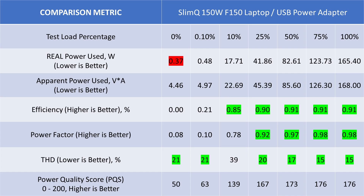When we look at the overall data, the idle power consumption is high but the electrical noise is not bad. The overall performance numbers actually look good across the board. The adapter does not meet the Department of Energy 6 requirements — the requirement to be efficient in real power terms and use low idle power consumption — although it didn't claim to. The voltages were riding the low end of the tolerance and fell outside of the USB specification for power delivery, so you may run into some issues with this device. The voltage held up on the DC barrel plug, though.